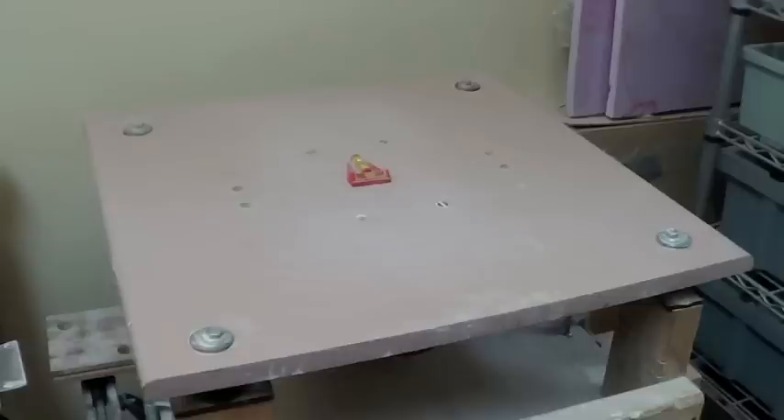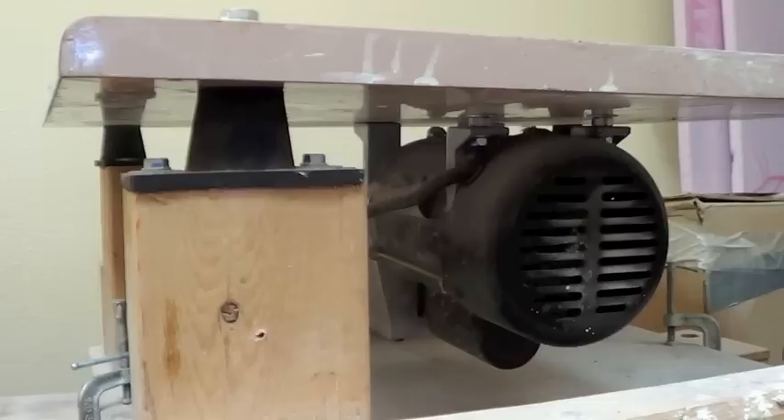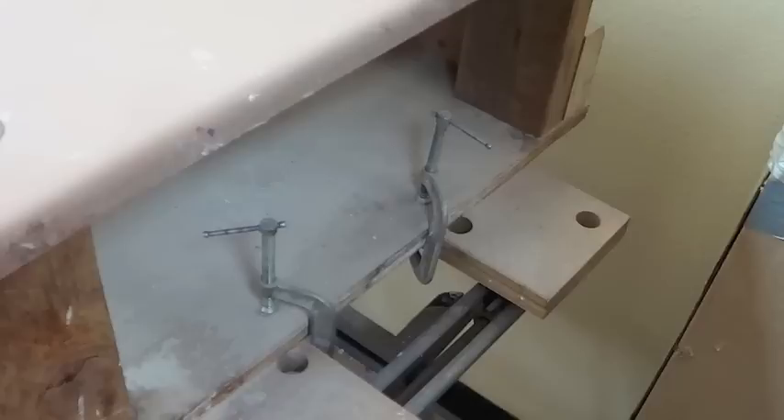It's really easy to make a shaker table. I got a piece of Formica countertop and put 2x4 legs down to a piece of plywood. At each corner, I put a vibration isolator to isolate the top from the rest of the structure. You can buy vibration isolators from Amazon.com. I clamped the whole thing to a Black & Decker portable bench. Very importantly, when I clamped it down, I also shimmed it to level the top. If the top isn't level, the mixture won't end up level when it vibrates.